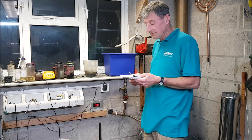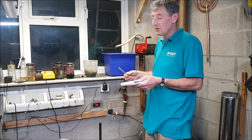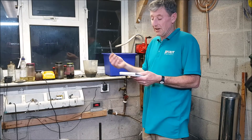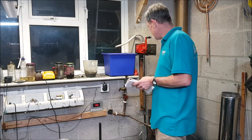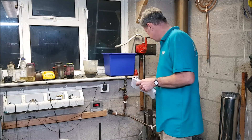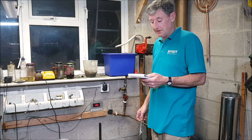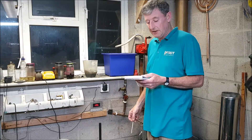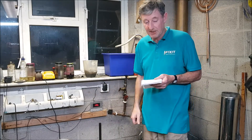That's not bad — I can quite live with that. It's a lot less than I thought. In a previous video I said I thought it maybe used two and a half to three liters in an eight-hour day — it's not. It's about two liters in an eight-hour day. So there you have it — that's the efficiency of my waste oil heater. Make sure you subscribe, leave any comments or views in the comment section, and I'll get back to everybody. Thanks for watching — see you in the next video.